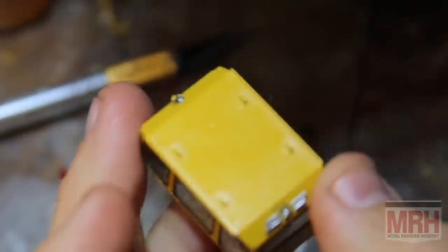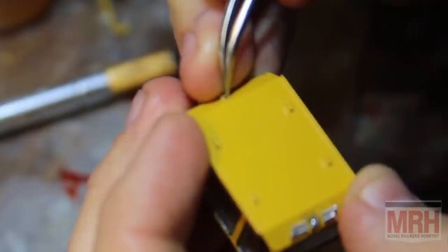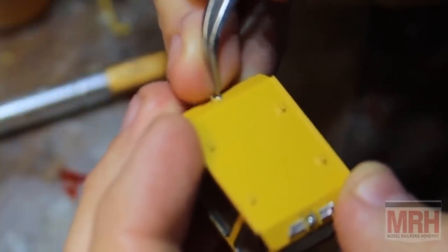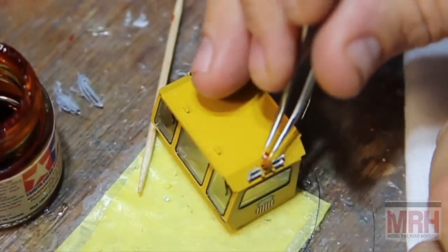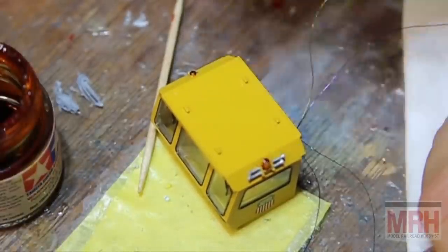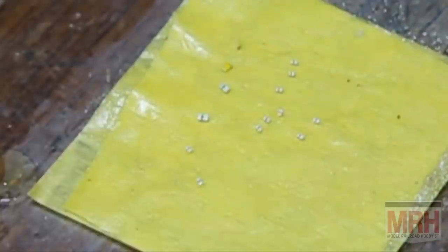Once the number 78 hole was through, I followed up with the 1/16th inch bore through the strobe mounts. Because I had a number 78 pilot hole, the 1/16th inch bore seemed to go a little bit quicker. As in the other countersinks, I wanted to drill as far as possible without boring all the way through the cab ceiling. My idea was to have a hole deep enough to put the LEDs in at the base, with 1/16th inch acrylic tubing cut to size to serve as the diffusers. With that, it was time to begin assembling LEDs for installation.